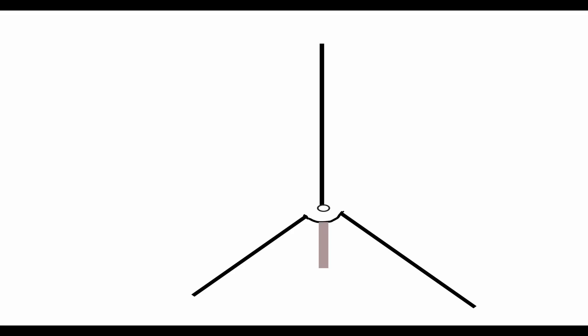If we look on the screen here, this is a very rough and ready sketch I did of a ground plane antenna, and you can see that it is above ground. Ideally those radial legs should go down at 45 degrees — the reason is that apparently gives you about a 50 ohm impedance. It doesn't matter whether they go down at 45 degrees, 30 degrees or whatever; you don't want it too steep, but I would say 25, 30, 40, 45 degrees really doesn't make a heap of difference. The effect is right. So you're aiming for a quarter wave vertical antenna that is above the ground.